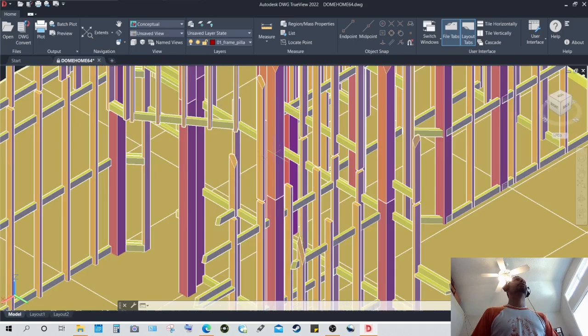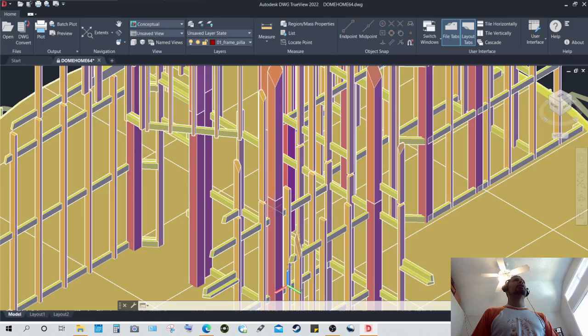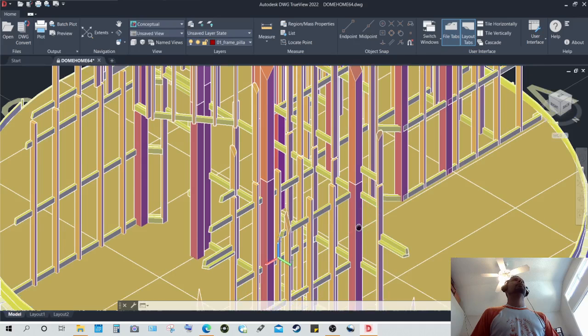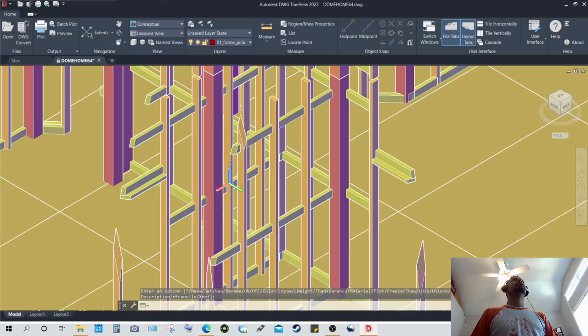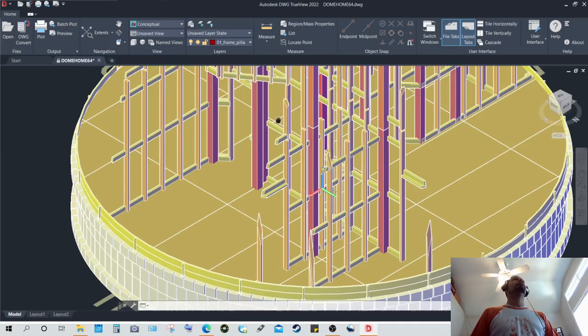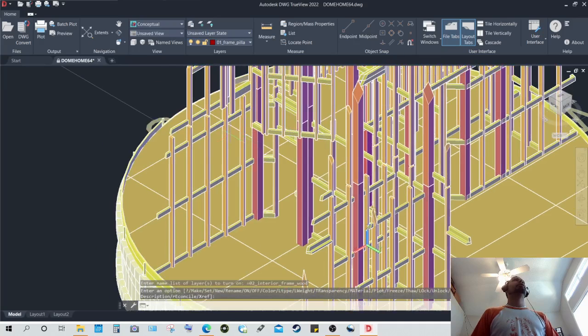And the bigger pillars, those dark red or dark orange columns, are designed to be 6x6 standard, which is 5.5 by 5.5 inches. And that is the width, the cross section. Of course, the length varies as shown in the construction drawings. And the ones shown in green are the cross members, the support members, I call them, the cross bracing, to maintain integrity and stability.